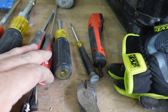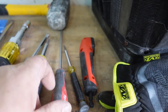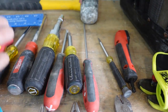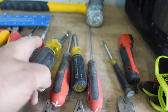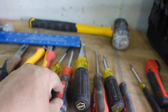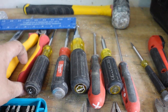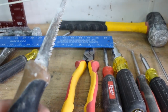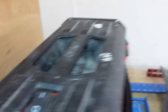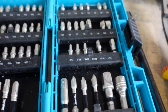Gloves. All your hand tools - an 11-in-1, five-in-1 screwdrivers, mini screwdriver, extension screwdriver. That extension screwdriver is great for wall plates. A number-three screwdriver, a nut driver for putting stuff together - also great for electrical. A flat-edge you can use with a hammer just to beat stuff. Lineman's pliers are fantastic for cutting. Drywall knife for cutting out holes. A drywall square for your basic drywall cuts. Hammer to drive nails, scissors, tape, and a quarter-inch bit set - just any driver set.